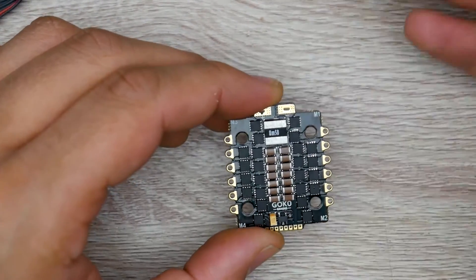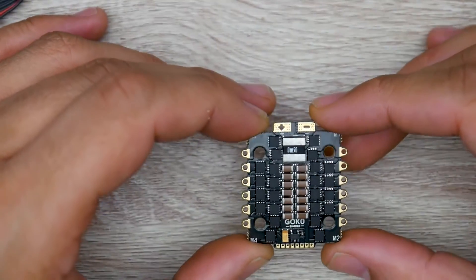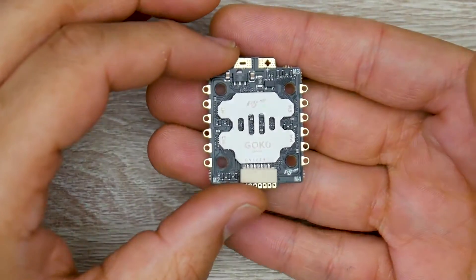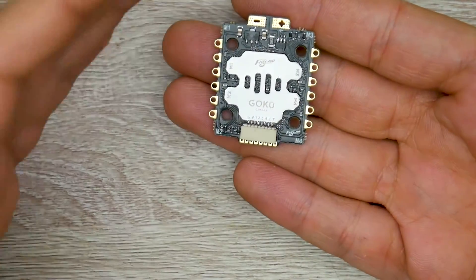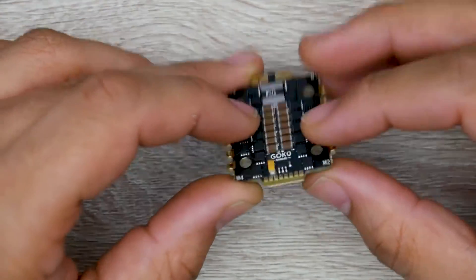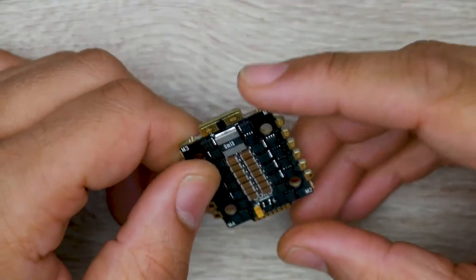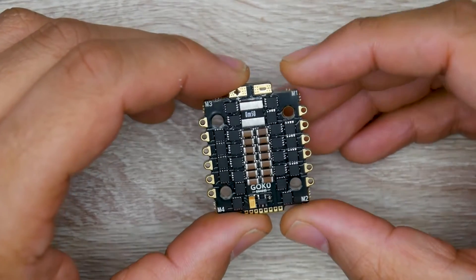You're not going to get separate current readings for each ESC, which is unfortunate — that was basically one of the main features of BLHeli32 back then, but we don't see it anymore. There's also a little tiny heatsink here, but I think this is mostly aesthetic, because usually you'd want the heatsink on the FETs down below — those are what have all the current going through them to the motors. The MCU and FET driver heatsink is more of a design aspect than functional heat dissipation.